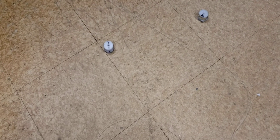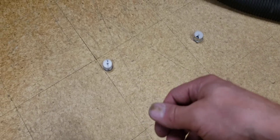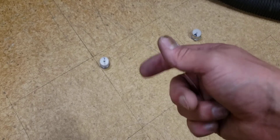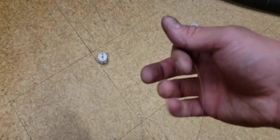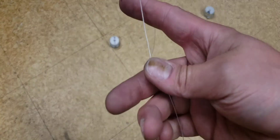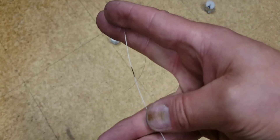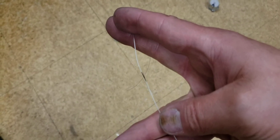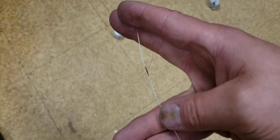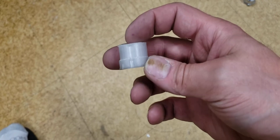You're going to get two cables that are 12 feet long — one will be for the right stepper and one will be for the left. What I've done is marked the cable at one-third, so at the four-foot mark there's a black mark right there. That is the mark that you want inside the spool.